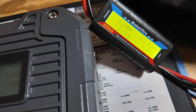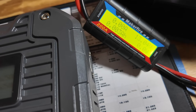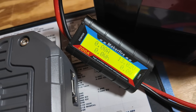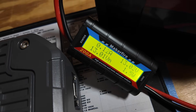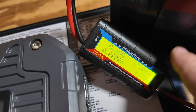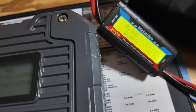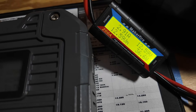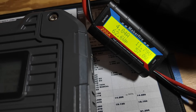One of the things I was really curious to see was how much power this thing was going to consume — when it's just sitting there and when we're transmitting — because my plan is to run this as a battery-operated system with solar panels. Right now it's giving us about 1.5 watts sitting idle, and it kind of varies up and down. When we transmit and key that up, you're looking at about 5 amps, or somewhere around 60 watts.